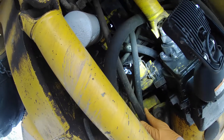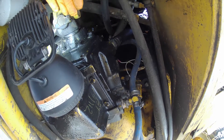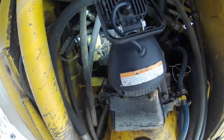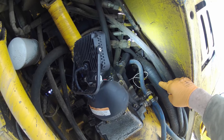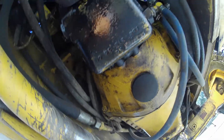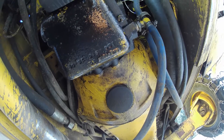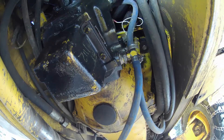I believe I show a little bit of that in a video. Once you get the reverser started coming down, there's a reverse switch on top which runs the back alarm and the neutral switch. If that neutral switch is not in the right place, the engine won't run — it signals if it's in reverse why you can't start it, so it has to go into neutral. Also watch this big hose, which is the hydraulics for the whole machine — the bucket, the backhoe and everything — you have to take it off to get to some of those upper bolts. Once that big line comes off, you're going to get a lot of fluid, so if you have a way to drain the tank beforehand, it would be better.